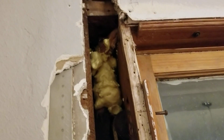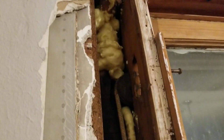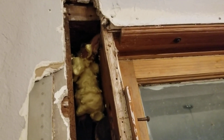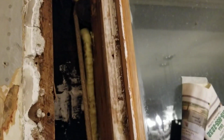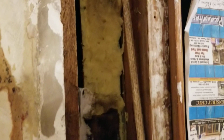Anyway, so back to this. Spray foam, there's a huge gap at the top of it that isn't used, so anything above that pulley is just dead space. It's not used. So I'll be filling in more once I insulate the top, filling more spray foam in there, making it a nice tight cavity. And then I went through, and any obvious cracks, that was pretty thick, like that, I ended up spraying in those holes.